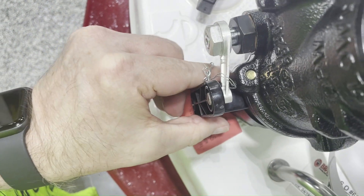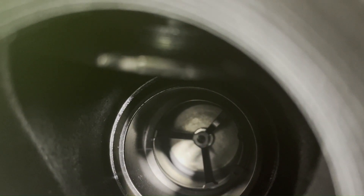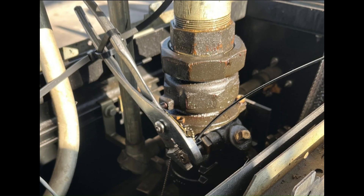This is the shear valve section of the piping under the dispenser. The silver flap inside the shear valve is up when the flapper valve is in the open position. When the shear valve is activated, the valve slams shut, stopping the flow of fuel from the submersible turbine pump. Having the shear valve tested annually is a federal requirement. This picture shows a shear valve that has been redneck engineered, not allowing the equipment to function as designed.